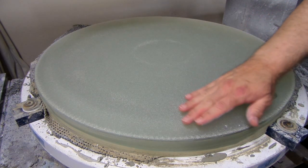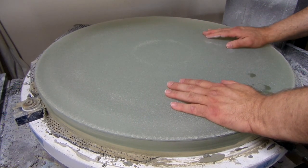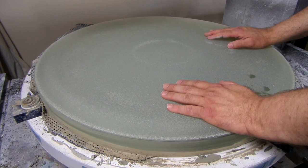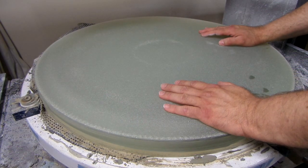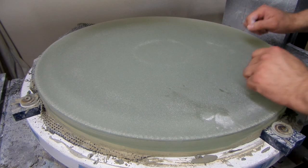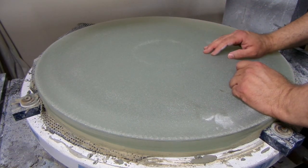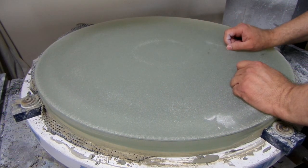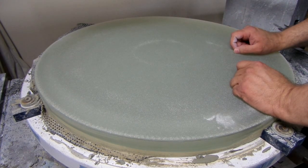But free-handing it like that, I was left with a surface that isn't particularly flat. So now I'm back in the shop with this on a regular grinding table. I've been using regular loose abrasives — silicon carbide abrasives — and a steel nut grinding tool in dental plaster to flatten the back. I did several sessions with number 24 silicon carbide, which is pretty much gravel — very coarse. When I got close I stopped and did some sessions with number 40. I'm going to do one last session with number 40 on the fixed post grinding machine before moving on to finer abrasives.